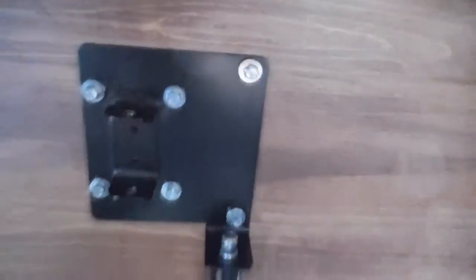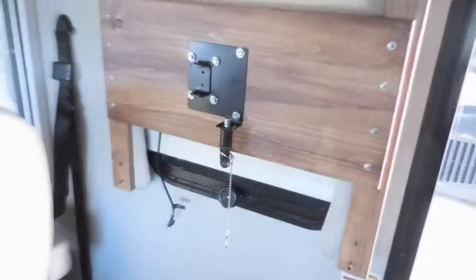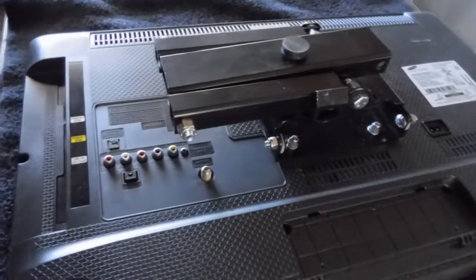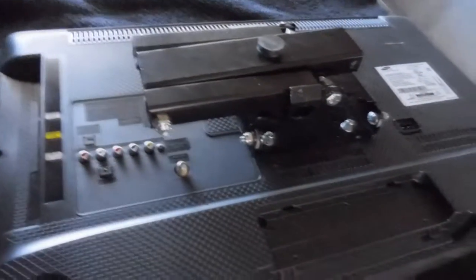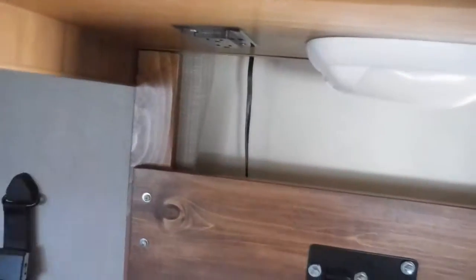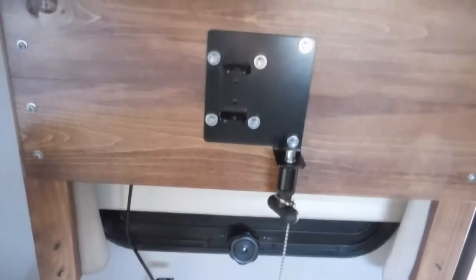This valance by itself is a 1x mounted to the wall, and then there's probably a quarter inch old Masonite in here that will carry the weight of that TV. Now this is rated at 25 pounds. I would estimate that this TV with the mount may be approaching 8 or 9 pounds.